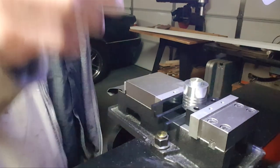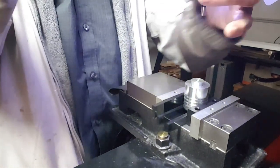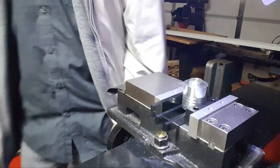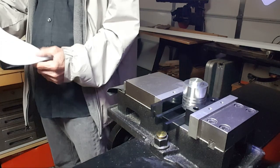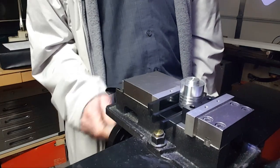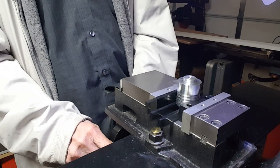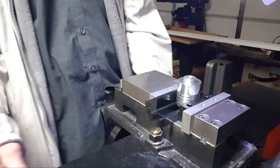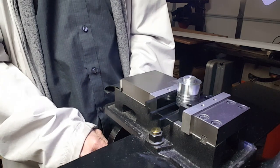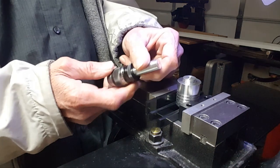So now I need to drill the air hole back here for the crankcase. It really has to be on the money to line up perfectly. So I need to, according to the print, move back 437 thousandths. 100, 200, 300, 400, oops, too far, 36, 37. I'm going to lock that axis, and I'm going to lock that one. I went to 38, see, moved. 37, got it.